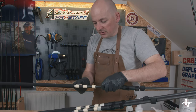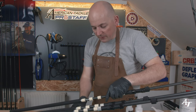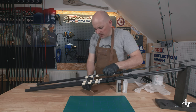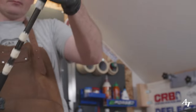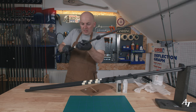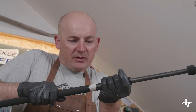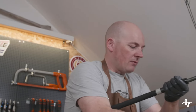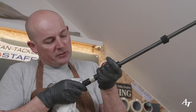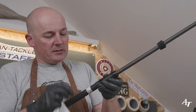And take some glue and just lay it on our arbors that we built up. Make sure to coat right up around the arbors. Always make sure to fill around the front. That's where you could get water ingress, really. Now, when we get down to the bottom here, I'm just gonna let the glue turn into that gap that I've left. And then I'm gonna get myself a little bit of rag. I'm just gonna turn it in position and just wipe away any excess.